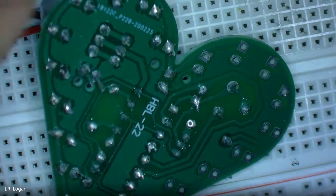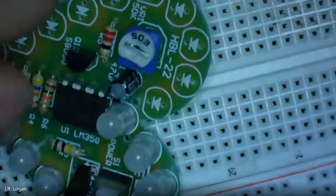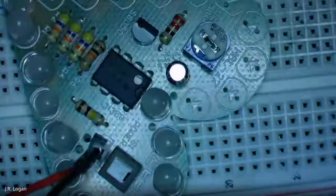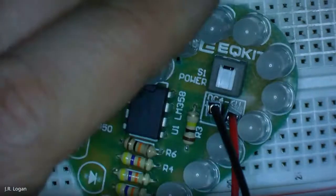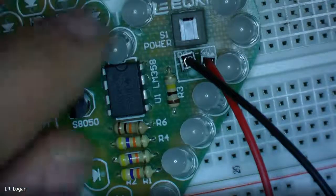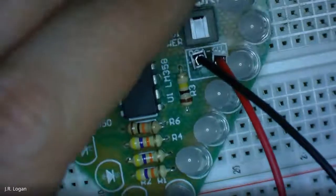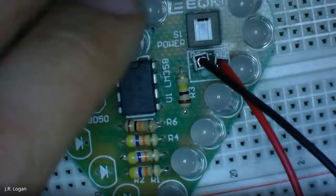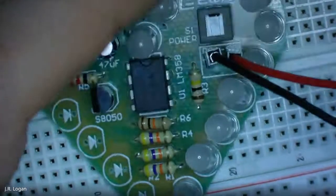One other thing to mention is some of these houses will actually pre-populate. So you'll pick from a list of components, and they have a machine called a pick and place. What a pick and place does is it's like a CNC machine for your components. Your components will all be in little buckets or often in a tape where it will be able to exactly pick that up. It's a little robotic arm that picks it up, drops it on the board, and then solders it all in place. Typically, when you're getting smaller, so through hole, the things that we're doing, there are all these holes and we're soldering, this is human scale. You can actually work with it, bend it, and see. Even though it feels small, it's manageable.